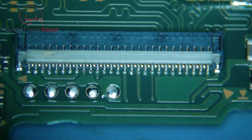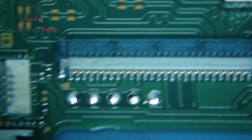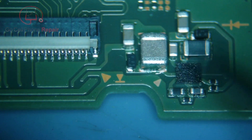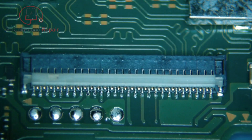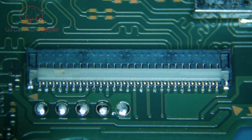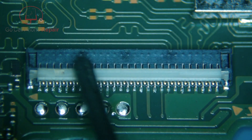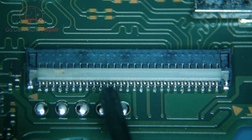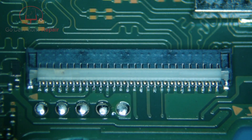The real challenge is this - we need to be careful. If we use hot air, obviously we can do some damage to the adjacent components, so we'll tape those off and make sure that they're insulated. If we were to try to pull this off of a donor board, it's really tricky because this piece likes to melt pretty easily. If you remove it, it's not easy to put it back on. The little white gate that clicks down here is really tough to get into the corner.